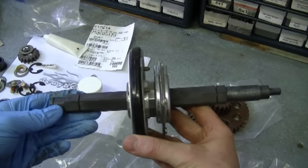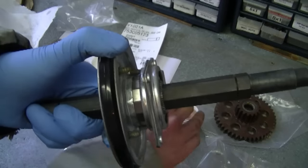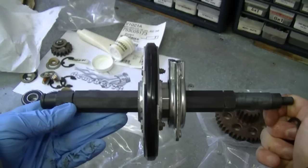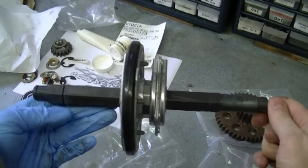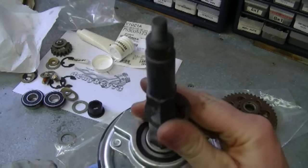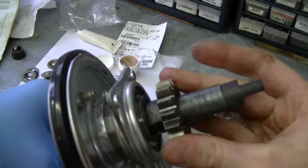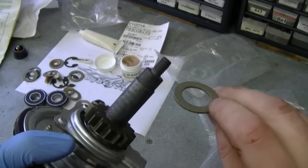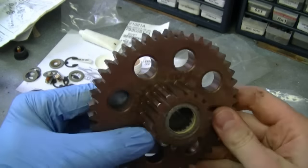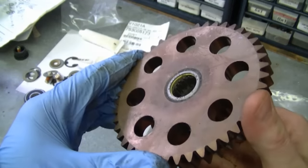Now I'm going to put the parts back together for the friction drive with the shaft. Put a bit of grease around the shaft. Make sure you have the friction disk assembly on the shaft — this part points toward the side with the bolt. Install an e-clip in there. Next, install one gear onto the shaft, then grab a washer from the collection and insert it. Grab the next gear, add a bit more grease to the roller bearing inside — it's important that you do this before assembly, and every year you should grease the roller bearings inside these gears.